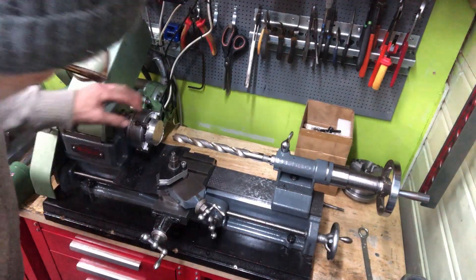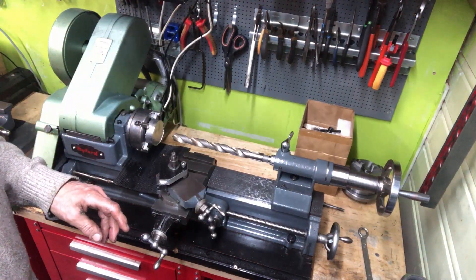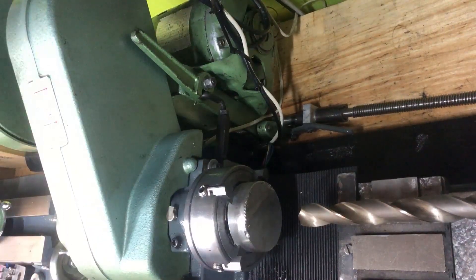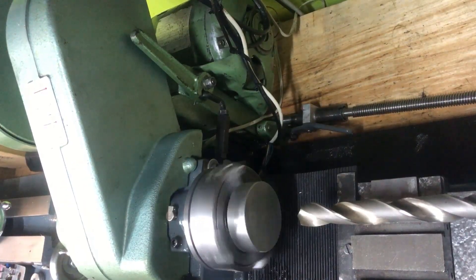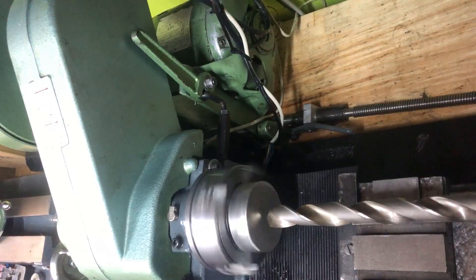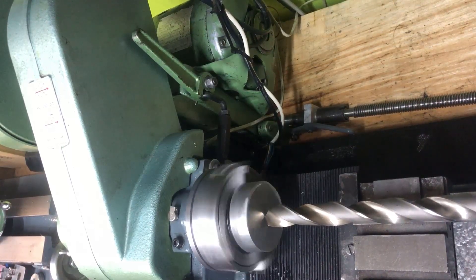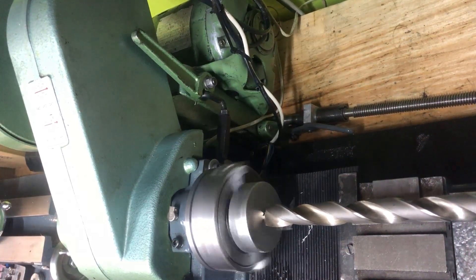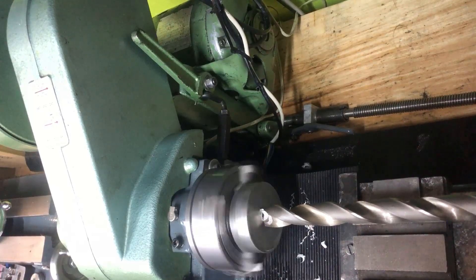Just do away with this tool and move it a little bit around. We'll just try with this directly — it may wobble a little bit, let's see. I'm trying first with the lowest non-back gear speed, which is 299–300 RPM. I'll just set this here, set the tailstock in, and then try. Of course, not how you should do it from the start — but you see it slips.